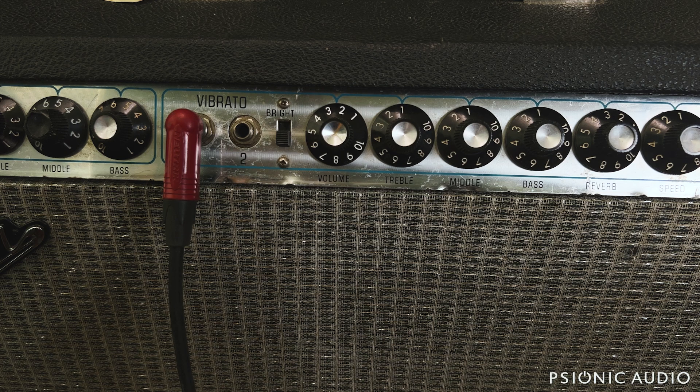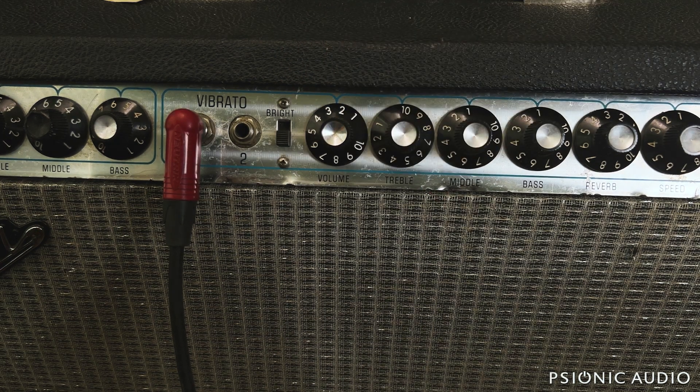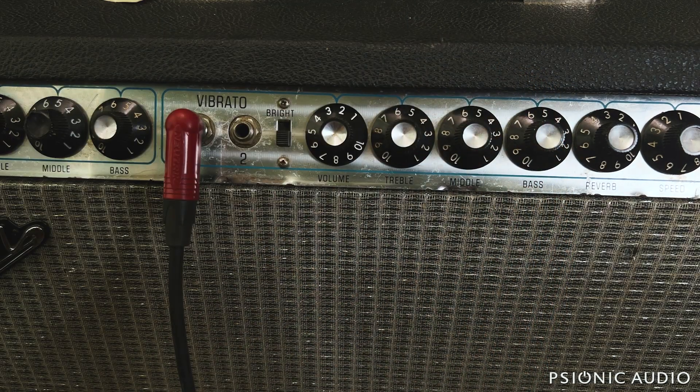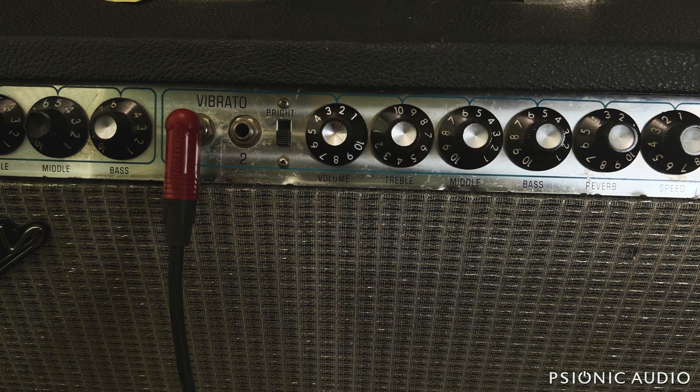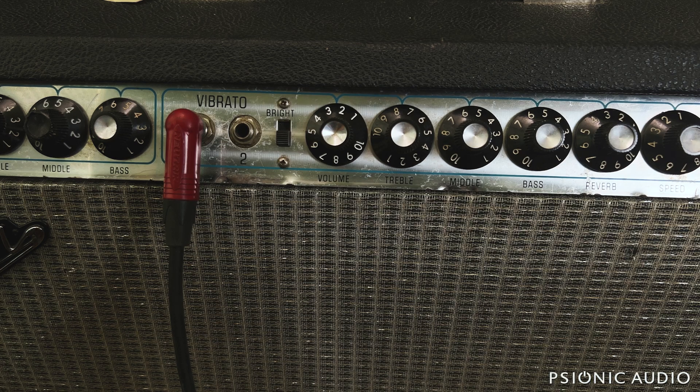It means you can also hear just what each one sounds like by itself, kind of. Not really the prettiest sound. Remember I said that you aren't really boosting anything when you turn it up — you're just not cutting it as much. So on the treble by itself, or when really prominent, that's a really harsh frequency. It sounds hard. You've got to just fine-tune it with the other controls. I would not go any higher than what you see there — that's pretty dang bright.